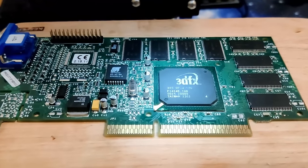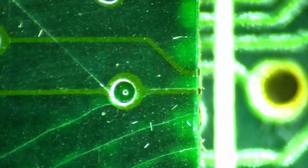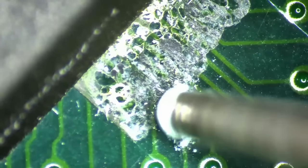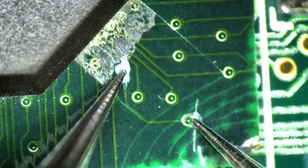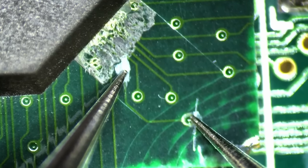Now we can properly inspect the damage on the substrate. The bottom right corner of the chip seems to have been damaged as well. You can see several cracks in the substrate, but there is only one wire that is located in the damaged area. I tested the continuity of this trace to the wire and to the pad underneath the chip. The multimeter confirmed that the connection is still intact, which is a bit surprising, but I am happy that we don't have to work on this corner of the chip.